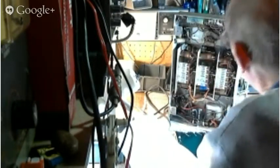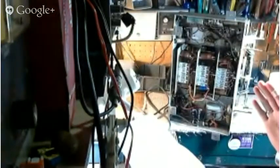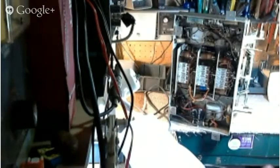You should be able to determine what's what by interfering with these coils when the radio is operating, noting the effect, and watching for the oscillator effect. The oscillator effect is the radio tunes up and down the dial. The others, the signal just gets weaker and stronger, stronger and weaker.